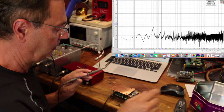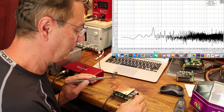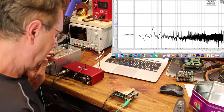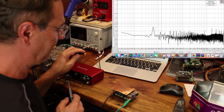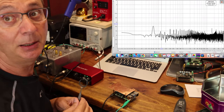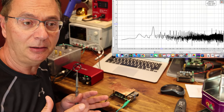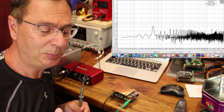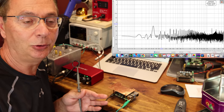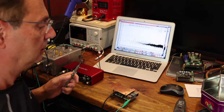Conclusion: it's good to earth-ground your Raspberry Pi — by earth ground I mean the ground in your wall socket, the main house ground. Also put a shield on top of the processors, attach the ground to the shield itself, and ideally encase the whole thing and ground it to earth. Note that 'ground' can mean different things — sometimes ground just means all negative poles tied together, but that's not the same as earth ground. In this case we are talking specifically about earth ground.